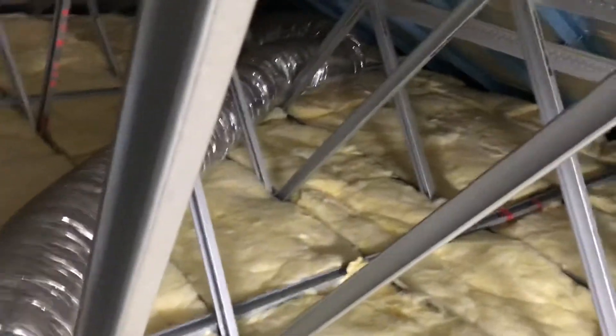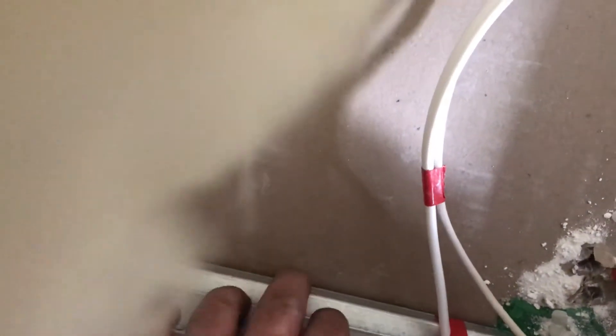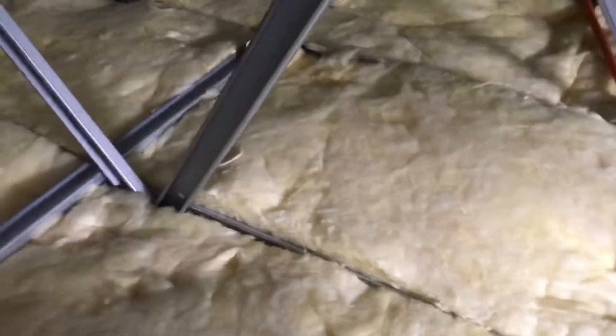The other thing that's not good for a steel frame house is that steel is a really good conductor of heat. All the steel is up in the hot roof environment, and if we just lift this up, the steel conducts heat straight through onto the steel frame and onto the fasteners. All the way through your house you've actually got these conductors transferring heat through to the inside.